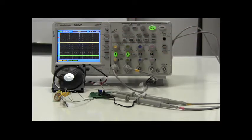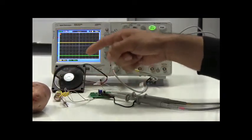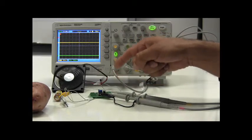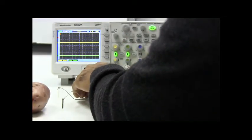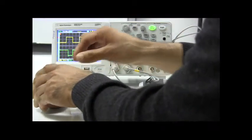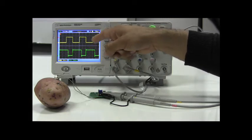Given that the TS-3001 is the world's first and only timer that can operate with a supply voltage of 1 volt and consume only 1 microamp supply current, I wonder if we can power the timer with — how about a potato? If I now remove the 1.5 volt battery and connect the copper and zinc electrode to the potato and monitor both the F out and PWM out outputs of the TS-3001, you can see how F out in yellow and PWM out are anti-phase and are switching at a frequency of 25 kHz.